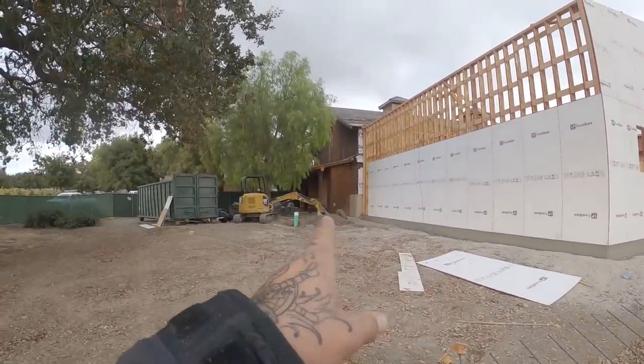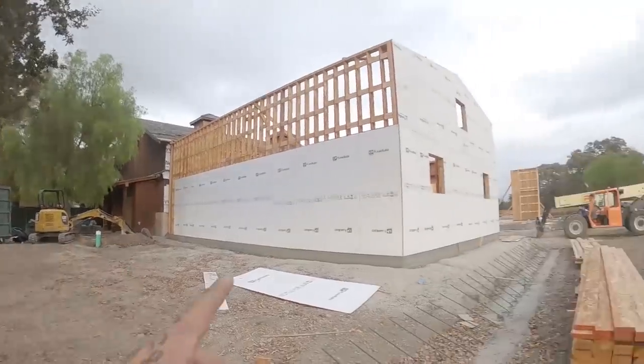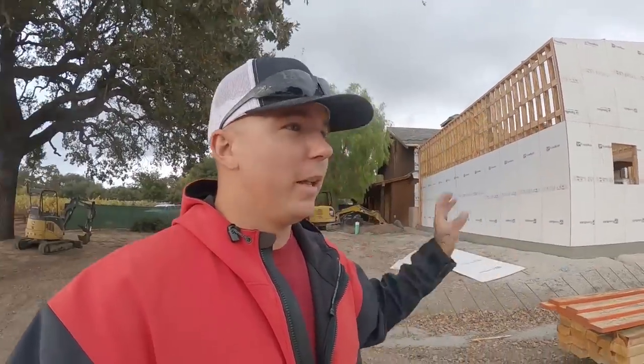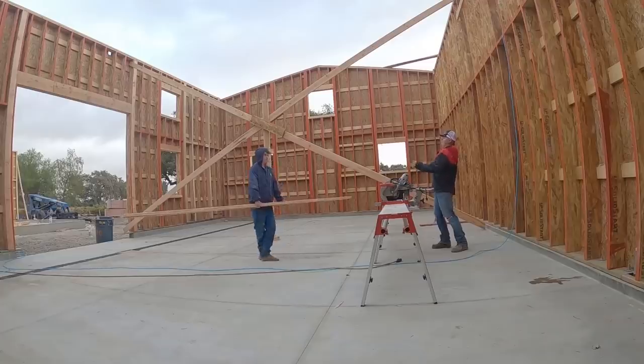We are at end of day - day 11. So far, so good. We got this section out here sheared. The guys were over here working so we wanted to leave them alone. We fell back and got that wall stood out there. Now the builder has a man basket coming, so we're going to wait to do the upper sheets until we've got that - we'll hop up there and throw those sheets up. This whole unit at that point is done. Once the rest of that plywood goes on, we've got our X bracing through the middle of the place to line it. I put up our string lines today and we are looking money. I have no doubt it's going to take a little bit of adjustment, and we're going to be golden.